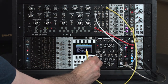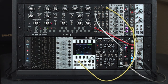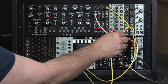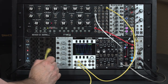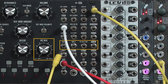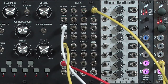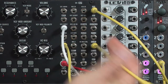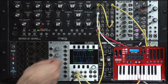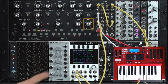I'm going to change to my oscilloscope display so you can see and hear what's going on. Go into input number two — there's my sine wave. I'll take the output and mix together this reference oscillator with my filter's output. I could use a couple channels in my Levitate, but I'm going to take advantage of the mixer built into the Mother 32. I'll mix input one there, take the mixer's output, go to my external audio input, turn the mix to external audio, and set the VC mix to the mix one input. There's my sine wave.